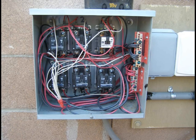Nine: there is no dead front prior to the main cover, and the main cover has no locking mechanism on it, only a Phillips screw. Ten: the panel cover is unlabeled as being live or energized.